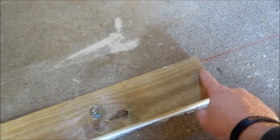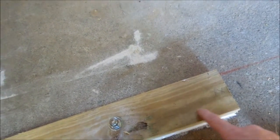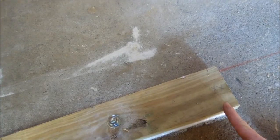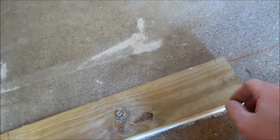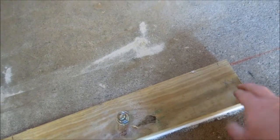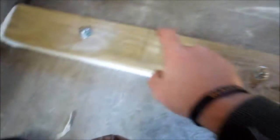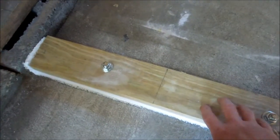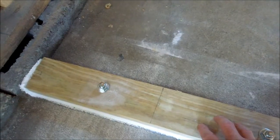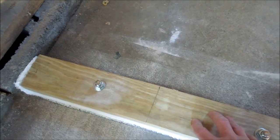And so it's actually going to be 3 inches here of 2x4. My next 16-inch center mark lands about right there, so it's going to land right on the center of this one, but I need another one there to the end where my door is going to be. So 1, 2, 3, 4, 5 studs going in this wall. Now as far as my bottom plate goes, I want this to be pretty much watertight.